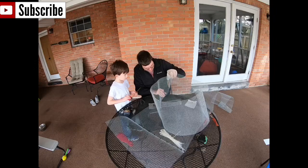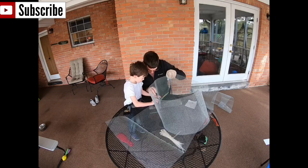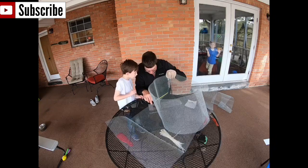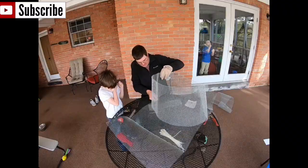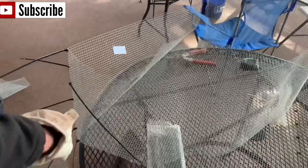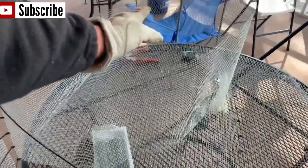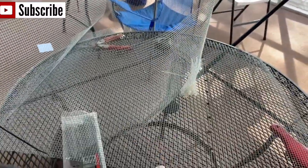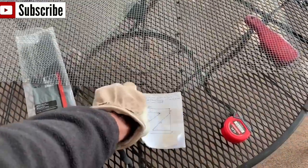On this bottom base, measure eight inches — all the way on the bottom like this. See where eight inches is? It's going to be right here. We're going to put a zip tie right here at eight inches. This is the corner we just made — stood the two sides up — and now we're going to come out six inches this way, then straight out 13 inches, then over one inch, then back 16 inches to the eight inch mark, and then on out to the corner.